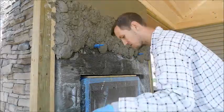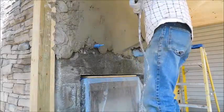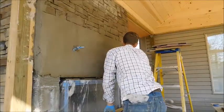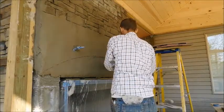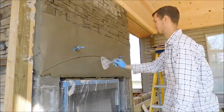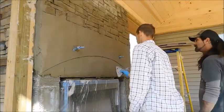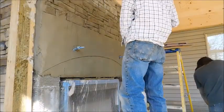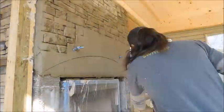Make sure you build your corners out good. The stamps we're actually using — I can't remember the exact name or pattern, but they are from Wall Tools. You just throw it on and spread it out with a trowel. You want to keep the surface a little bit wet and spray it every now and then so the face of it isn't drying out quicker than the rest.